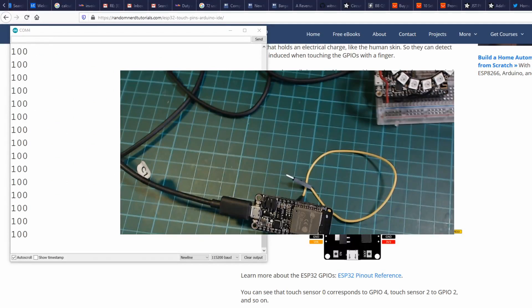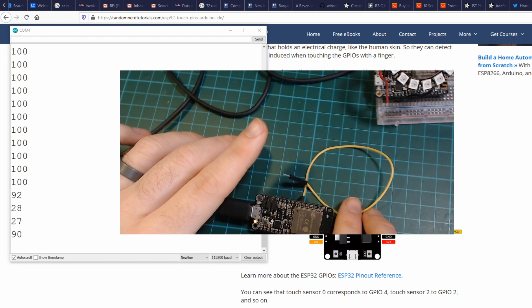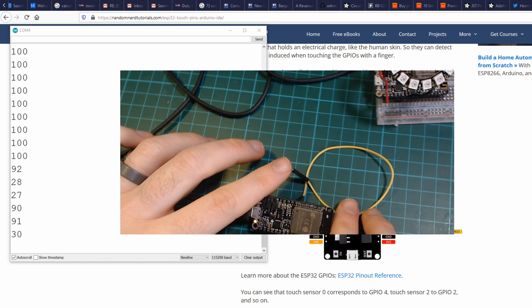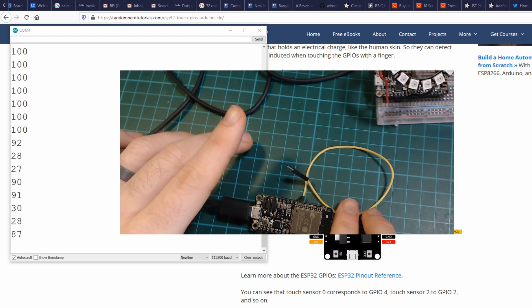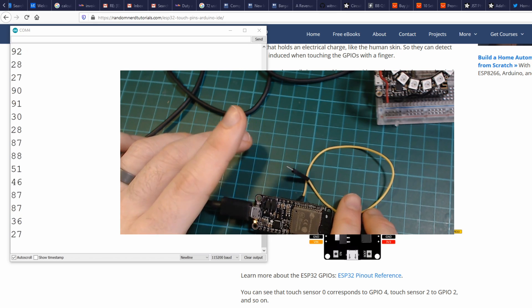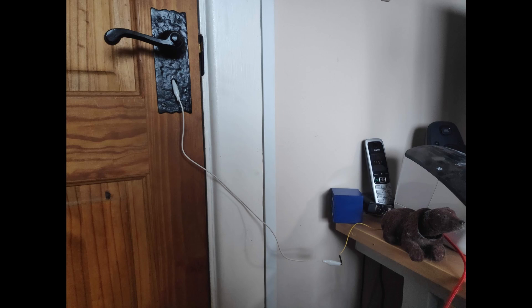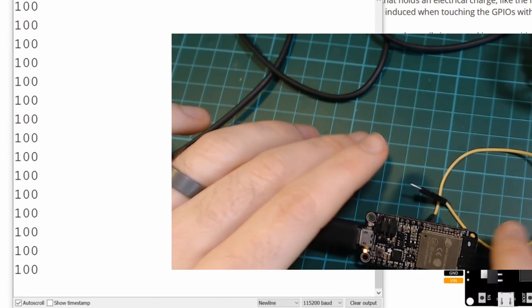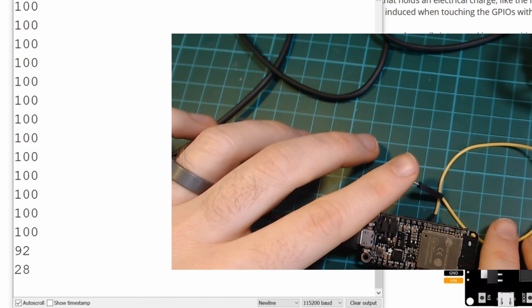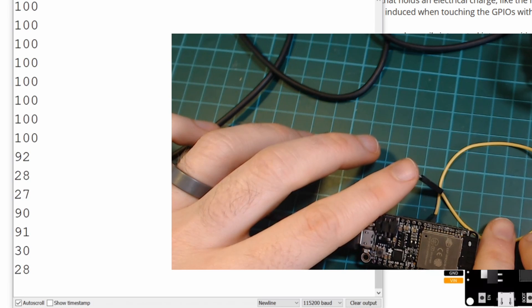For those who don't know, the ESP32 has pins that can be used as a capacitive touch sensor, which means you can just attach a wire and it will detect when something has touched it. I thought it would be really cool to set up the ESP32 on the inside of the door and add the capacitive touch sensor through the door handle. My initial testing was not good — there was a swing of about 70 in the values when I touched it in open air, but only a swing of 1 when using the door handle.